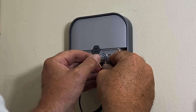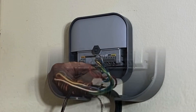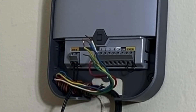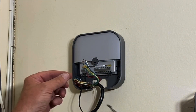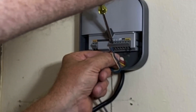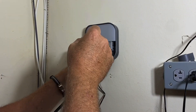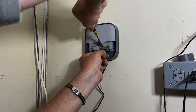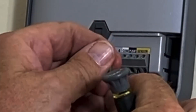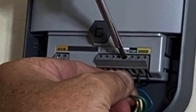I'm going to do red, yellow, white, and blue. It doesn't really matter since it's wi-fi — when I was running back and forth up and down the hill it really annoyed me. Make sure your zone wires aren't touching each other. Then my green is my common, and the commons are tied together outside at the valve box, so I've got one common inside.